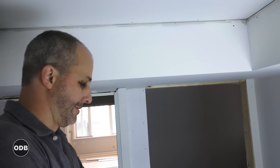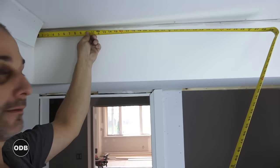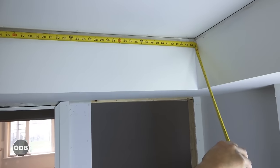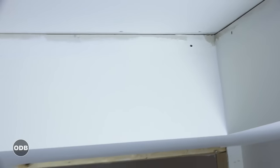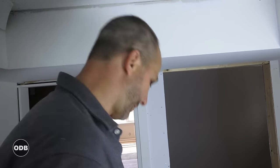Here's how we want to do this — we want to measure for the next piece. Right to the wall and behind the trim in the corner, over to the other wall. If you can pick that up on the tape, it says 46 and 5 eighths. Now I know from experience that's going to be a little bit tight, so we're going to go 46 and a half — just take a little bit off so that it's going to fit nice. We'll go to the saw, cut both angles in advance, and come back and set it all up.